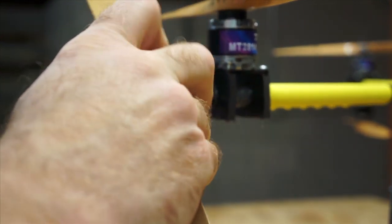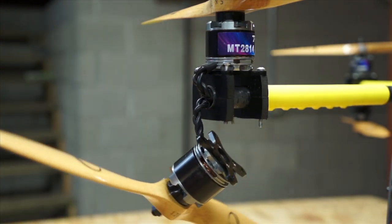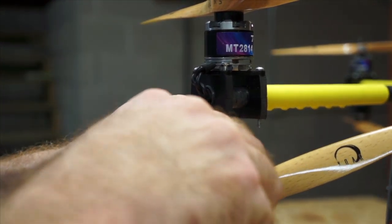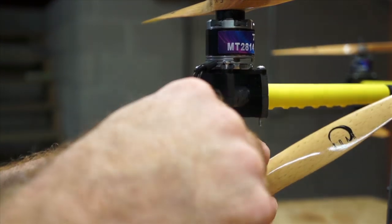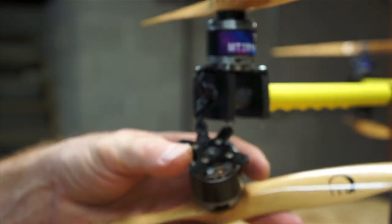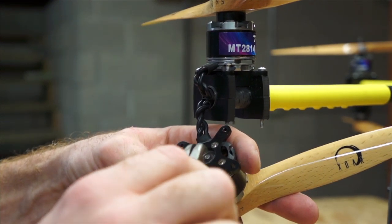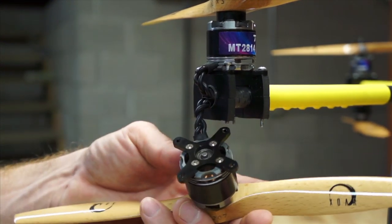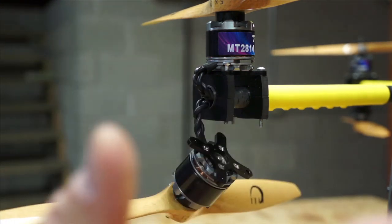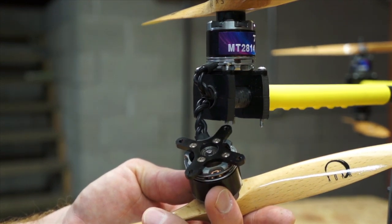We just snap the bell back in place. I always replace the washer and the spring clip. Here's my replacement spring clip. I push it into place using the point of my awl — my thumbnail on one side, the awl on the other side — and it snaps into place. Just to make sure it's where it's supposed to be, I move it around with the needle nose pliers. Sometimes if that spring clip doesn't go into its seat and gets hung up on the shaft itself without snapping into place, next time you fly the bell of the motor is going to fly off. So that's a good bearing replacement and we're all set to go.